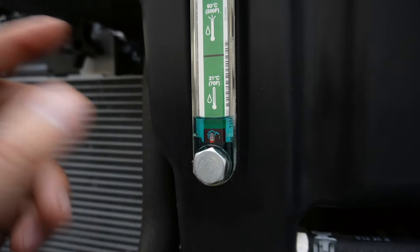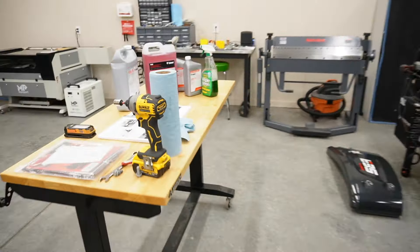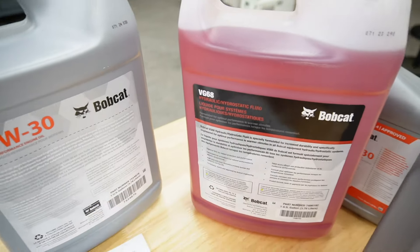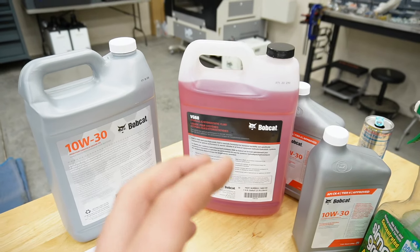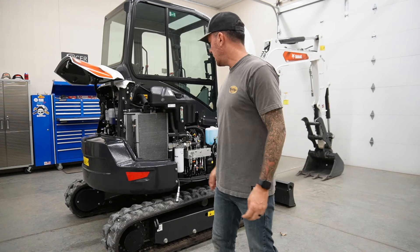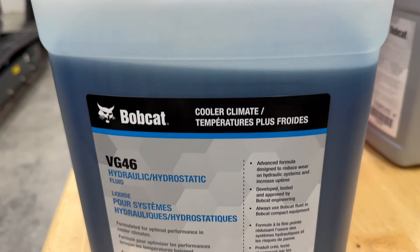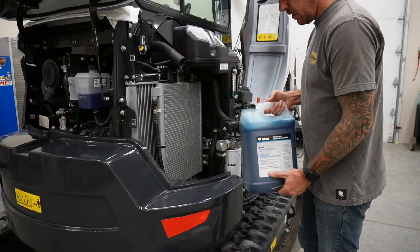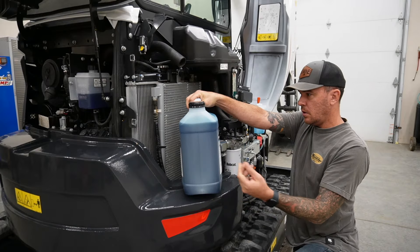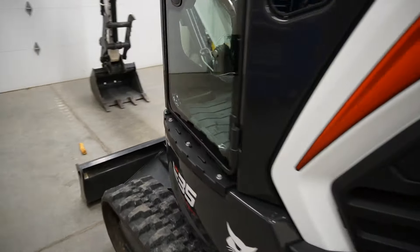With a quick Google search, it is not recommended to mix blue hydraulic fluid with red fluid. Even though the manual recommends Bobcat VG68, I probably shouldn't mix them — so I won't be able to use that red fluid until I do a full flush on the hydraulic system. I'm going to have to make a quick trip to Bobcat of Davies County. I am back with the blue stuff — this is VG46 hydraulic fluid. Unfortunately they didn't have any one-gallon containers, only two-and-a-half gallon. This was like $73.